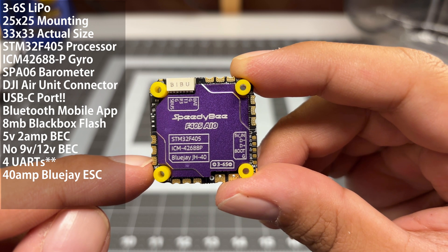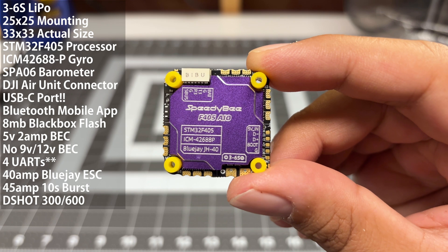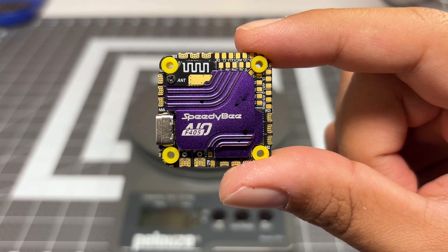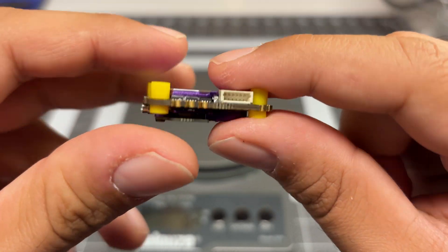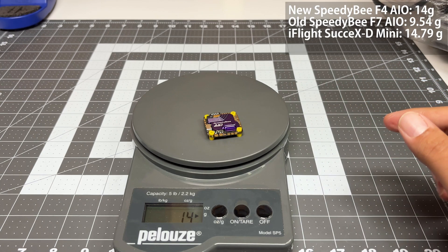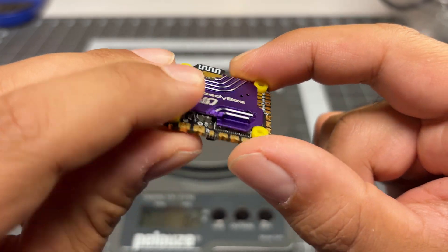The speed controller on here is BLHeli, labeled JH40, so it's a 40 amp speed controller — an upgrade from the prior generation — and it supports 45 amps in a 10 second burst, so speed controller wise it's definitely beefed up. Unboxing this I was quite happy and disappointed at the same time. All-in-one controllers like this are supposed to be bare bones, small, lightweight packages, but SpeedyBee has gone ahead and added all this purple bling and heat sinks, and you don't need it. The old version rated at 35 amps performed exceptionally without a heat sink. This is supposed to come in at 13 grams — and yeah, 13 to 14 grams — that's a lot of weight. I can run a separate stack for about the same weight. I'll attempt to remove the heat sink and see if that's possible.